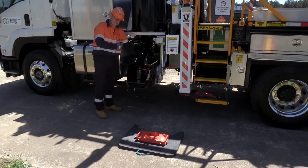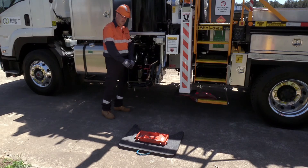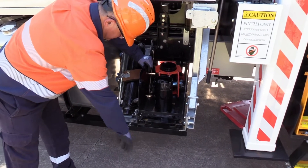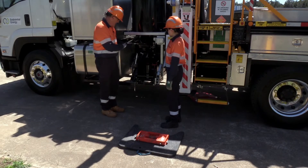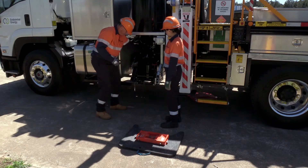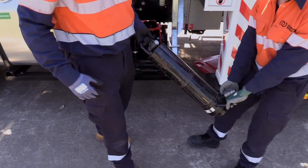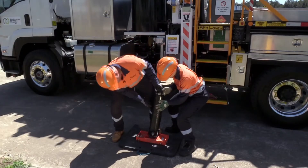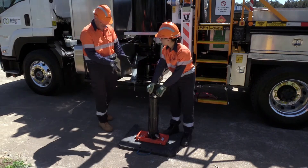To get the Tiger Jack, so we're not lifting in and hurting our backs, we need to slide this tray back in so it's not in our way — slide it in and lock it into place. We now need two people to lift the actual pole jack out of the stand and into the base. To do that, lean in and slide it forward, fitting it into the groove. Now we have the pole jack in place in the base.